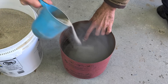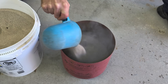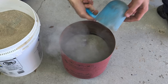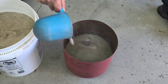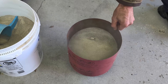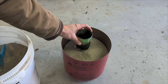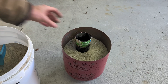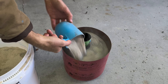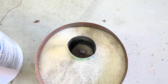I'll take the foam pattern that I coated with a layer of drywall mix, fill it in a container, and fill it with dry sand all the way to the top of the foam. I like to vibrate the container halfway to really lock that dry sand into place. After filling it all the way to the top, I'll place a pouring cup right over it — this is where I'll pour the molten metal in. Then I'll add more sand surrounding it to lock it in place.